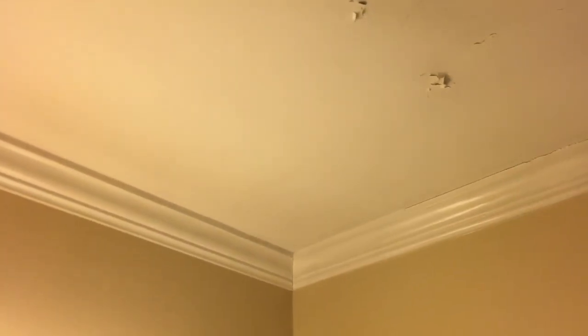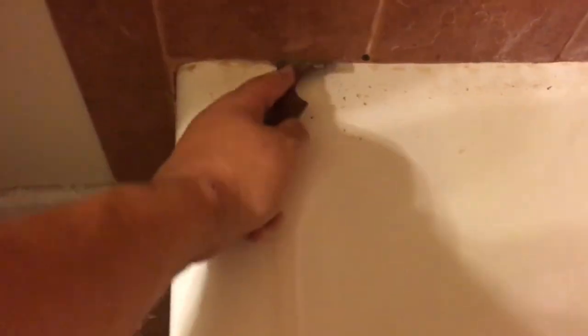Corner rack and that should be it, then we have some ceiling work — scrape, sand, paint. What you got to do is scrape all this crap out of here, get it clean. Take your time, scrape it nice and clean. Let me get the shop vac, suck this up, spray it with some Fantastic. You got to prepare this — if you don't have a clean dry surface, your caulk is not going to set up the right way.